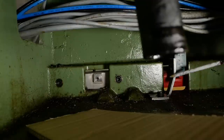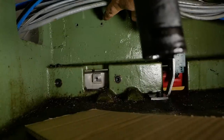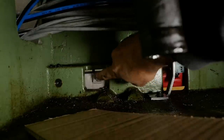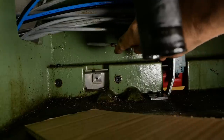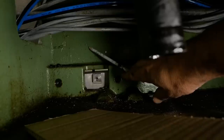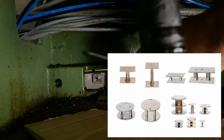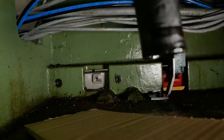Here's my e-stop switch on a bracket down on the ground. I'll pick up one of the holes up here which are mounting that other switch to pick up actuation from down below. I think this base casting is quite an amazing casting. These little marks with four holes — I think those are the chaplets, used to position the sand core which made up the big void in the casting. They're little sheet metal parts to stabilize that big block of sand; they just become part of the casting.